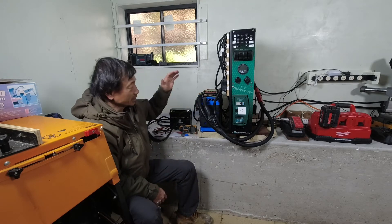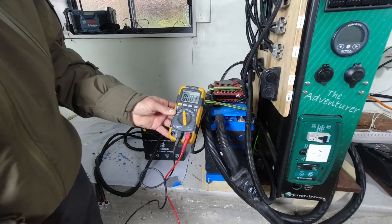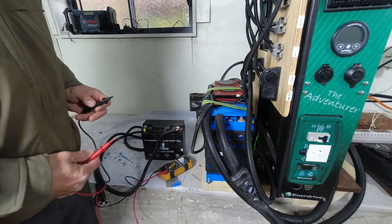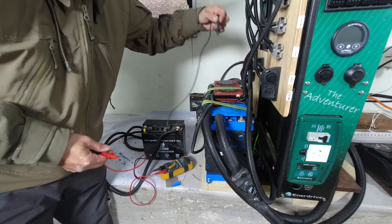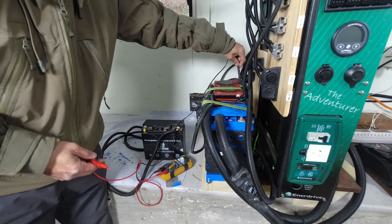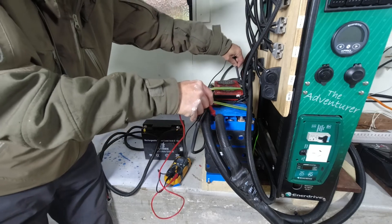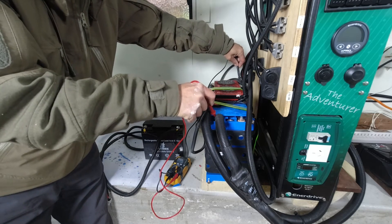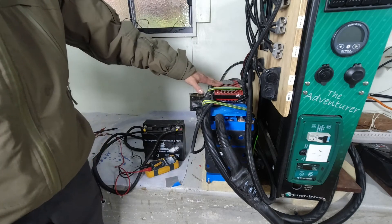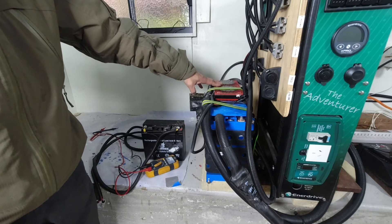Join me in this video as I attempt to reboot the battery management system and wake it up. I have here a multimeter and I will measure the voltage of the battery. Negative probe to the negative terminal at the battery management system and positive probe to the positive terminal of the battery. I'm reading a voltage of 12.02 volts. That is strange to me because in the battery management system configuration, the low voltage shutdown is 10.4 volts.